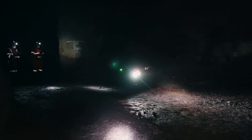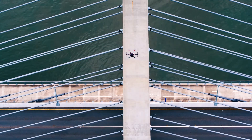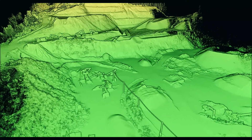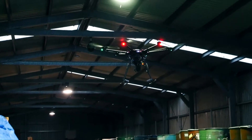The Hovermap comes in three packages. AL0 is what you'd be interested in if you're from the survey community. AL1 basically puts a bubble or a mesh around the drone so that you can guarantee asset management — ensuring you don't come within a certain radius of any plant, machinery or buildings. And AL2 is full autonomy underground or in an indoor space, where it maps the environment around it so that it doesn't bump into any objects.